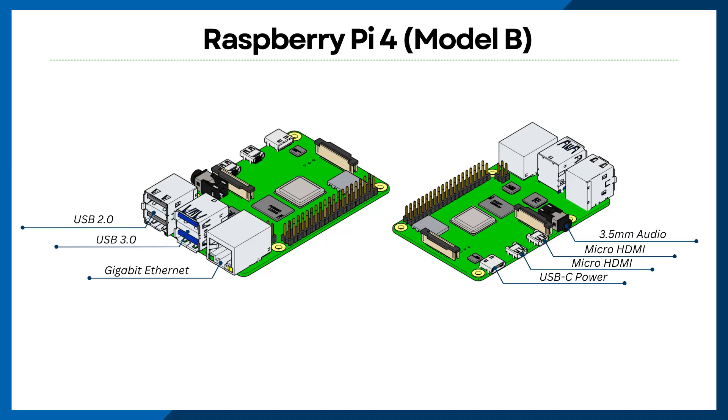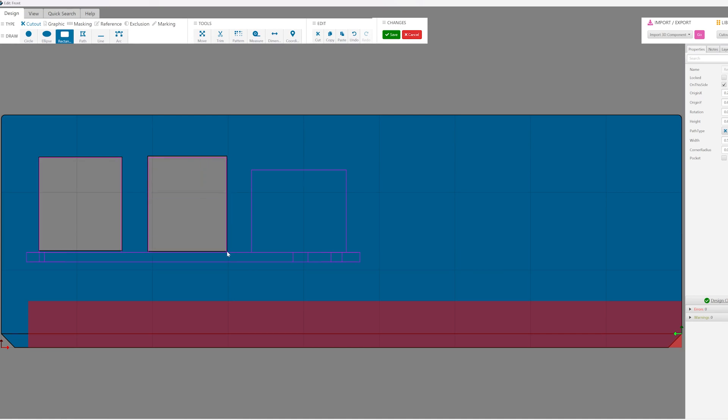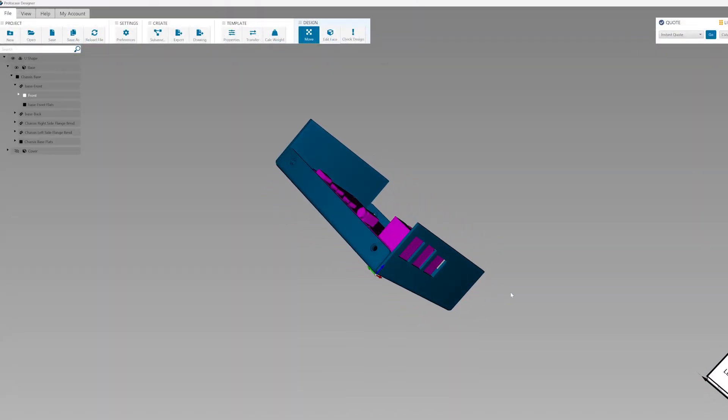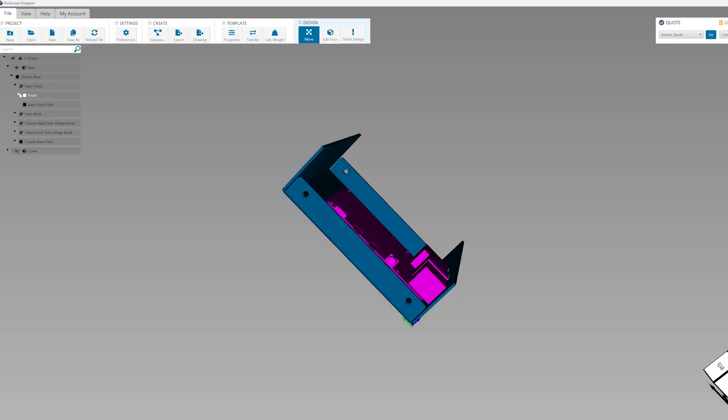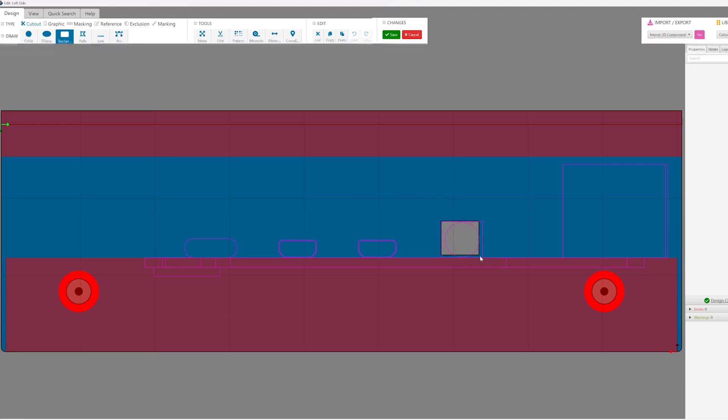As mentioned, we have cutouts for USB ports, the HDMI ports, the Ethernet port, the USB-C power input, and the 3.5mm audio jack. Back in the 3D Viewer, let's select the face to edit that contains the I/O inputs. You will see immediately the outlines of the cutouts from the board projected behind the material of the enclosure. This makes it really easy to precisely add cutouts for these inputs. After hitting Accept and returning to the 3D Viewer, we can now see that the cutouts have been added and the inputs are clearly showing. Let's do the same thing and add our cutouts on the face from the adjacent side.